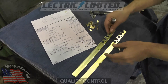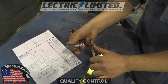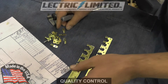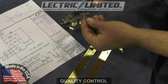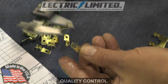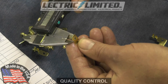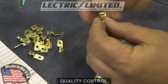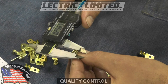As the parts are being made, several critical dimensions are checked. We're going to check the thickness of our material, which in this case is 32 thousandths. As we produce our part, we'll be checking other dimensions — the critical ones, namely the overall width running about 318. We want to make sure that our hole is centered, within about 2.5 to 3 thousandths. We'll also check the overall height of the form, where our wire is crimped in, and that's actually right on dimension.